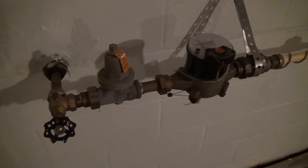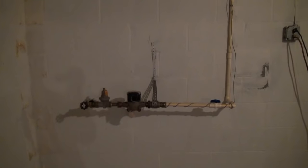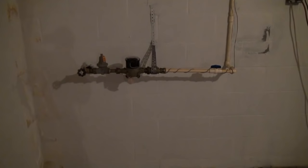I've come off the wall one foot so that I can get all of these pipes and meters inside a corner that I'm going to build here. I'm going to build a wall on that red line about a foot off the wall, and I'm going to put a 30-inch door — I've got it laid out right there on the floor. That corner is the very end of this water meter setup, so I'm going to put that whole little setup in a corner closet with a 30-inch door. When we're finished, we'll see a finished six-panel colonial door that will match all the other doors in the house. That's how we're going to swallow up design problem number one, which is a very typical one — just about every job I'm working around a water meter somewhere in the basement.